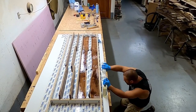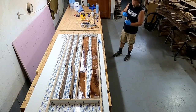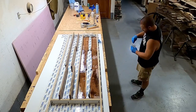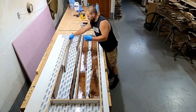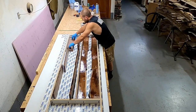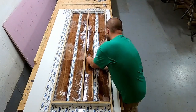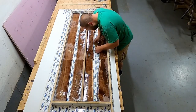It seems counterproductive to glue them down, but they're going to be held well enough once we do the river pour, while still being releasable from the form. I'm mixing up a second batch for the other side — doing six different epoxy river boards total. On the left we'll be using Stone Coat countertop epoxy and on the right Total Boat epoxy, though I'm using Stone Coat quick coat to seal and glue down both sets. I'll wait 24 hours, come back, sand the edges with 220, then we'll be ready to pour.